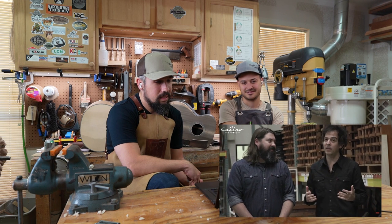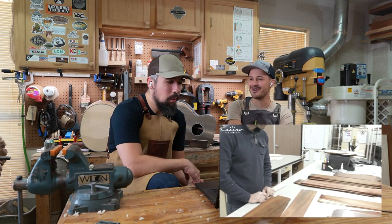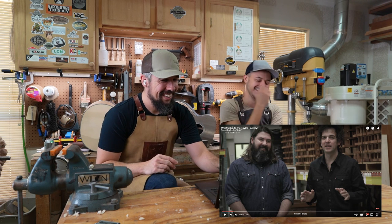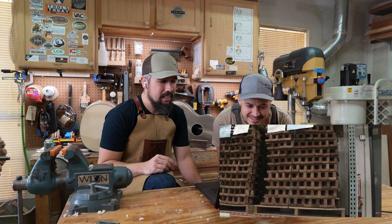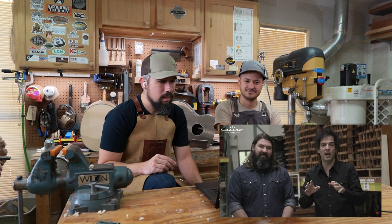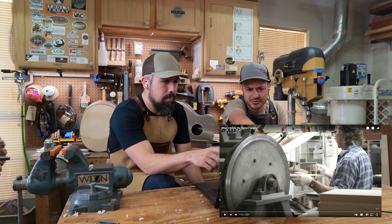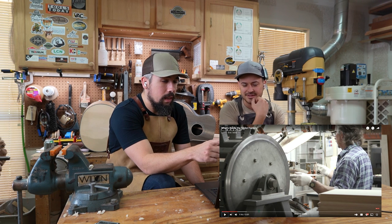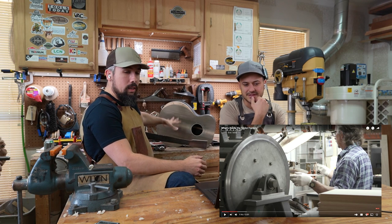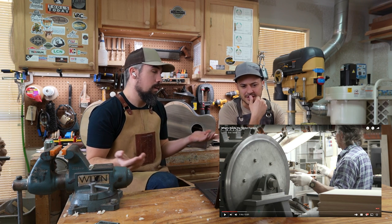Right now we're in what they call the laser room and the exotic woods room. This is where they just finished picking out some cuts and wood sets to turn into some beautiful guitars. You can see the two tops being joined — it's like a plate-joining jig on a rotisserie, a carousel. You can clamp the two top plates together like we've done before, and then just rotate it, because glue drying time is always a big hang-up in guitar building on a small scale. And it's pushing them together from the outside — super homemade, those are just bar clamps.